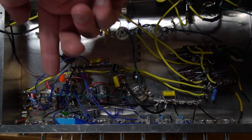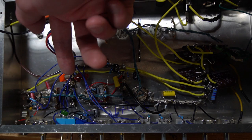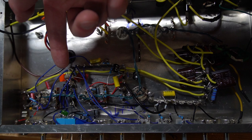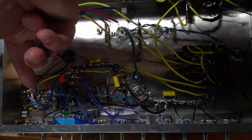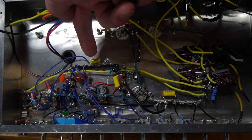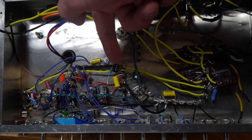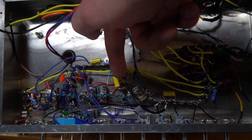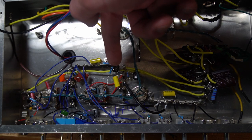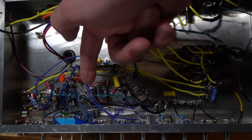Here are our three tone switches. It gets a lot of boosting and cutting and tone stack shaping. Comes back over here for a second gain stage. Travels out of the plate over to this area, and then we run along down this path. And then it has the ability to jump into the drive channel, which is right here.